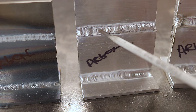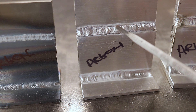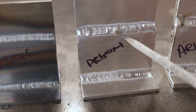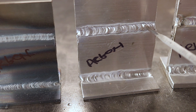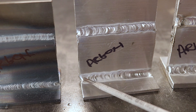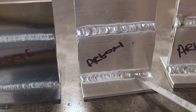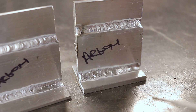Moving over to the 1/8-inch aluminum with argon — everything looks good, it burned in pretty well. I did have to move the torch out to the leading edge of the puddle a half inch or so a couple of times to preheat the aluminum, then come back to bring the puddle along. A little bit of work, but it came out well. On the T-joint, the aluminum was already preheated, so it flowed in pretty nicely, and right toward the end where it was really heating up it started to flow in really nice.